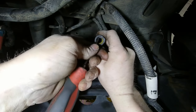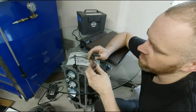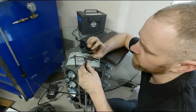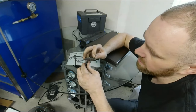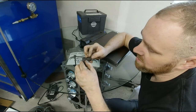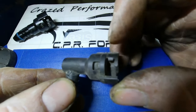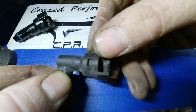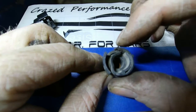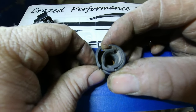One of the most common types of quick connect fittings — this one's also the same but a straight version. You see this little tab; this tab is the release mechanism. Normally when the line is on a vehicle it will be pushing down on this tab because the line pushes out under pressure, and there's a little latch that holds it. When you try to push it, it won't go — you have to literally lift up on it, then push that way and it'll release. This is actually my favorite connector because I don't need any kind of tool.